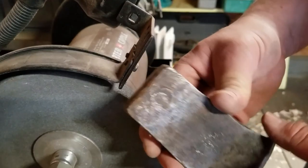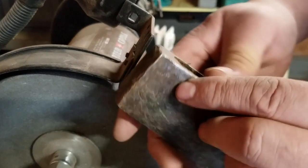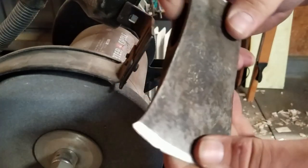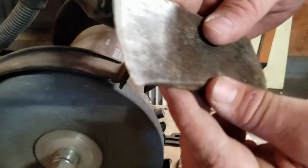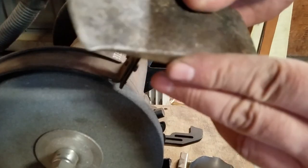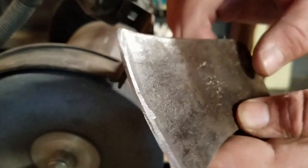You can see here there's some peening, and it's starting to rust a little bit, so we'll clean that up. I want to put a little more belly in there than it has now. Same thing here — looks like someone's tried to do it. It's a little flat but it could be nicer done. We'll hone the edge up and then we'll hit the whole thing with a wire wheel.